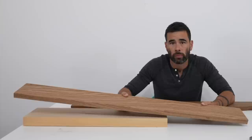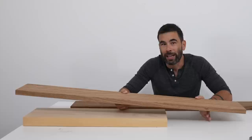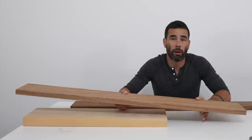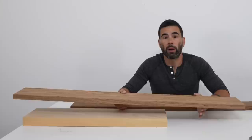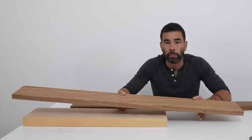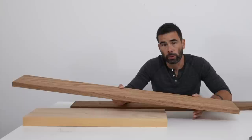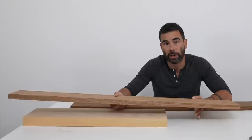This thermally modified ash is really interesting. I like doing a lot of DIY outdoor woodworking projects, but your options when it comes to wood that performs well and lasts a long time outside are pretty limited. There was always pressure treated, but there are so many chemicals in that I don't like using it too much. There are composite options, but those are difficult when it comes to glue-up, although pretty great for decking weathering. I use a lot of cedar, which is fantastic but has regional availability issues and is more of a softwood. On the hardwood side, I've traditionally used tropical hardwoods like Ipe, Masarinduba, or Tigerwood — they're probably the most similar to this thermally treated ash. The big difference is weight: the oil in those tropical hardwoods makes them a lot heavier and denser, so they're more difficult to sand and work with in general.